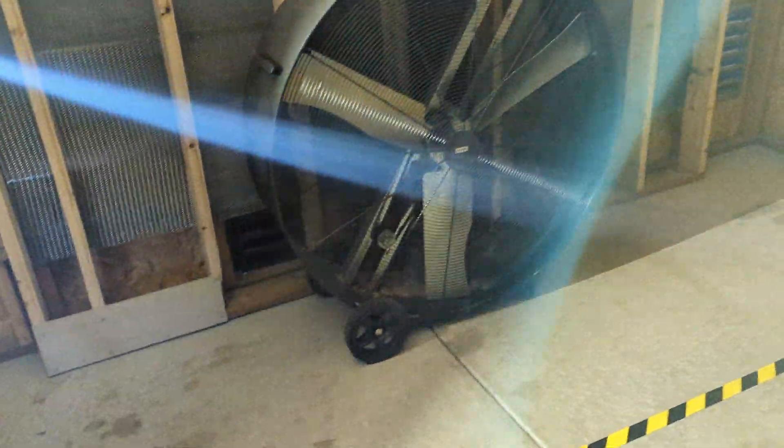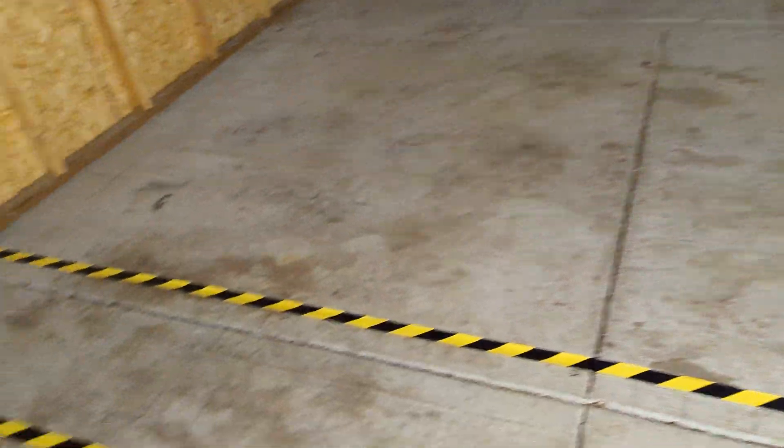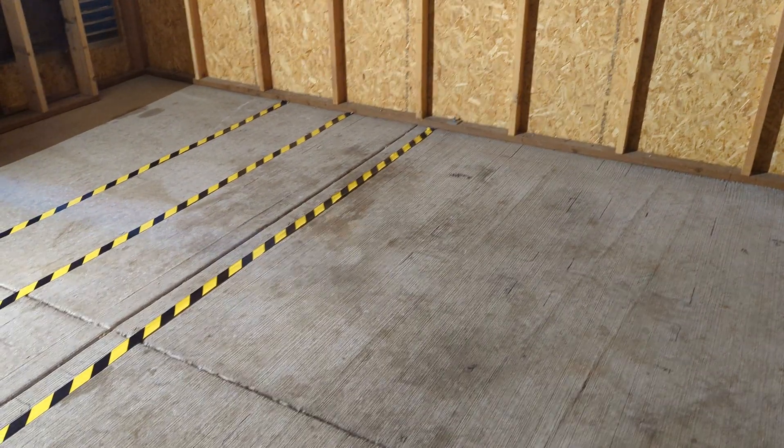You can see some of the drawings here for all the racks. Exhaust is going to be on that side and intake on this side. We're going to use the same type of fans we use at our other locations — these are 48 inch, 22,000 CFM fans. We have two of them pushing to the top and blowing out all the hot air. We'll also have two fans placed near the top blowing out the hot air. At 60 rigs running at 3,700 watts each, that's about 220,000 watts of heat to exhaust.